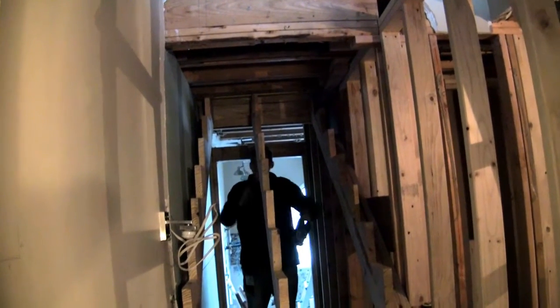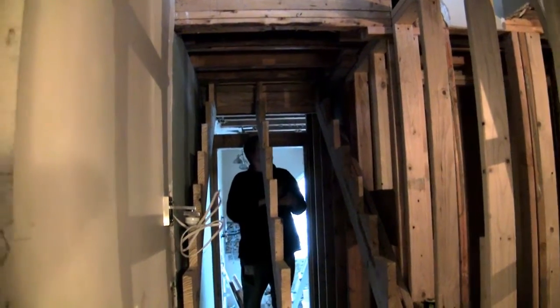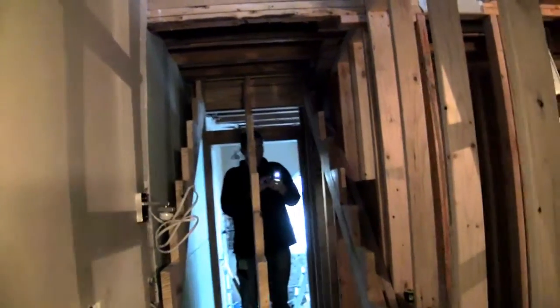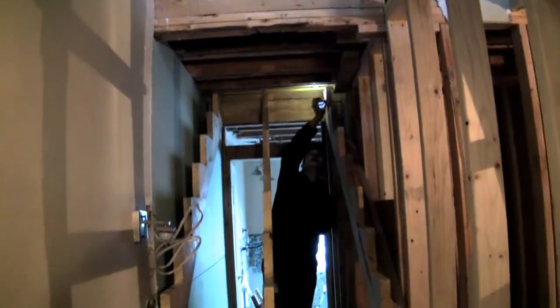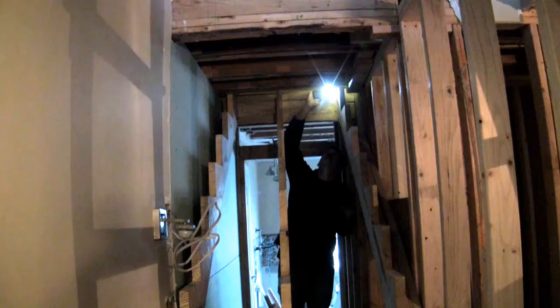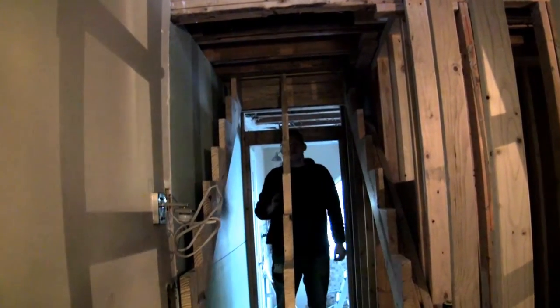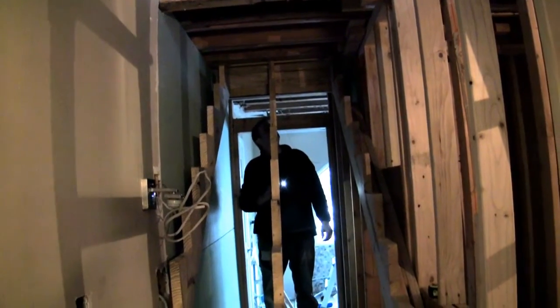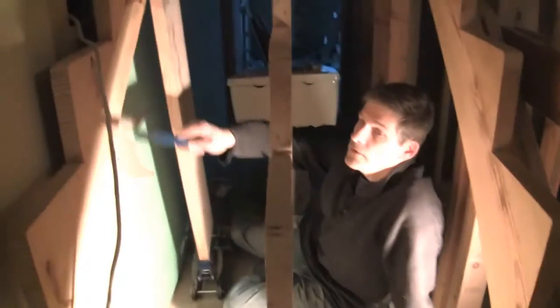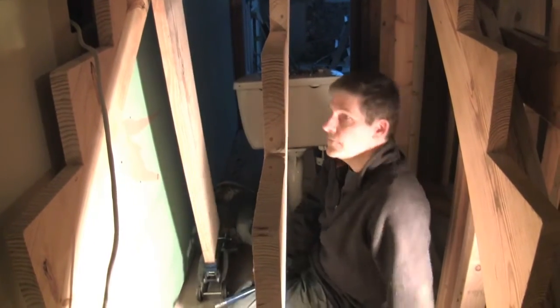And now we know this one bowed. This one, when we cut it, bowed down after we cut it. Probably for a moisture issue with the wood. So that is, holy camole, about as close to dead level as you can get. Yay. So our top stair is awesome. This one decided to bow down or crown to this direction in the middle. And so we've got that gap that we've got to make up.